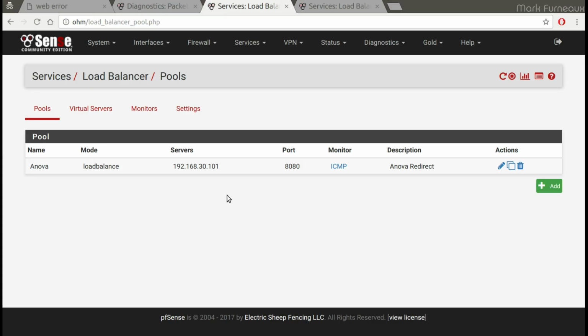Now I proved that this worked, first of all, just by powering the device up and turning the app on. The app couldn't see the device, the wireless light wasn't blinking, it clearly couldn't get a connection. Then I wrote a quick little Python script that just opens up a TCP socket and spews out the request asking what the device ID is, and it got a response, and I was able to decode it. So at that point, it's pretty much just a programming exercise to write the server.